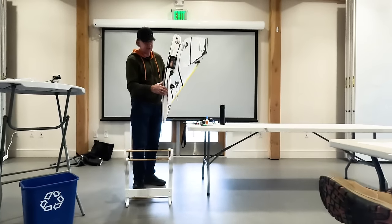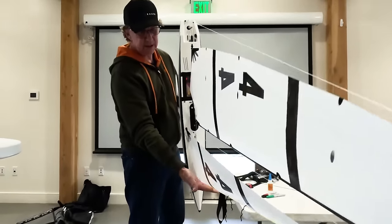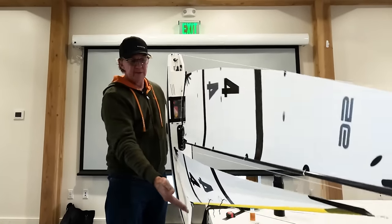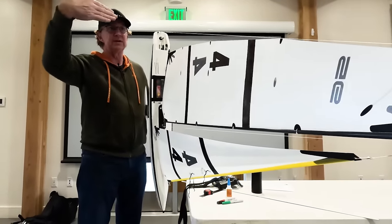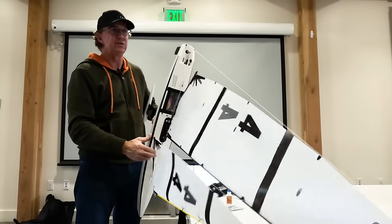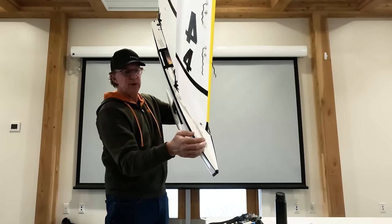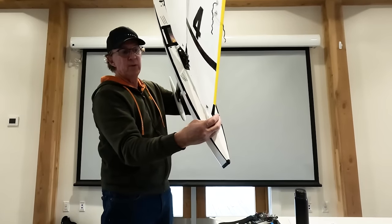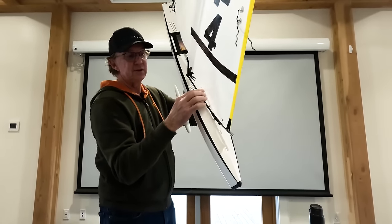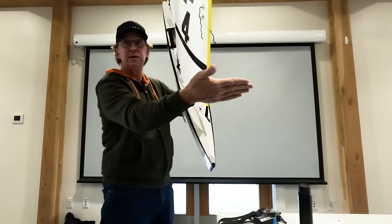With the jib, it's not just taking the jib leech clew off centerline, but you're rotating the luff of the sail towards the wind. So very quickly, you're taking away pointing ability. It's one of the reasons why I really freaked out about sailing with the jib too far out, because the luff is turning around this pivot point, whereas on a normal boat, the pivot point stays the same in the front of the boat, and it's just the clew that's moving. Well, here, it's a double-edged sword. You're not only losing back end, but you're losing front end to the wind at the same time.